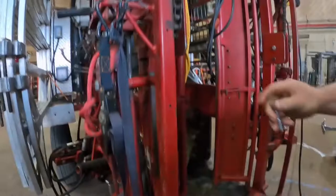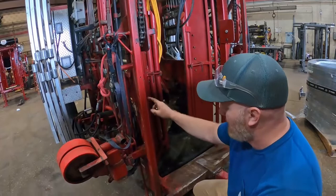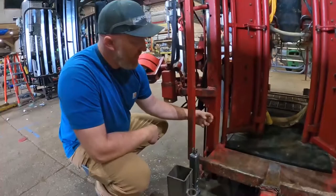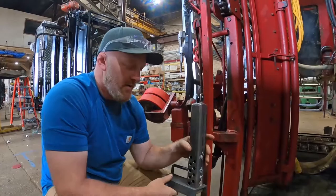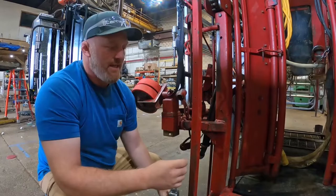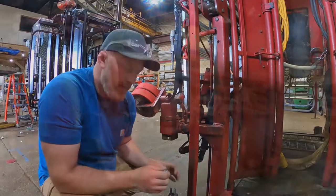See how this one fell down and this one is still in the up position. So what we're doing is we're going to lock in the jack tube, the internal one, so that we can work on getting the foot out of the inside of the internal jack tube. You've got the external one that you can all see, and then we've got a jack tube that slides up and down in there. It's connected through our chain system — this chain here pulls down on that inner jack tube to lift the chute up. On the inside of that jack tube you've got this foot here. You have the opportunity to level your chute if you're on level ground, pin it up, step on the bottom, and put a pin in so that one side of your chute can be a longer leg and keep your chute level on uneven ground.